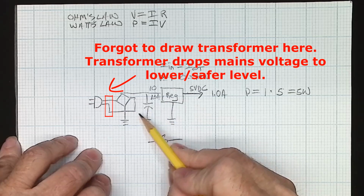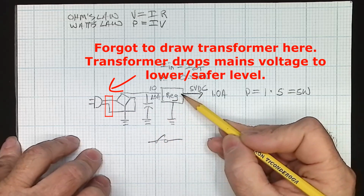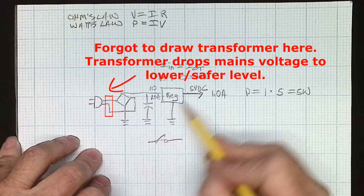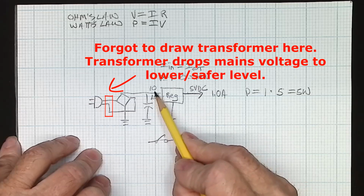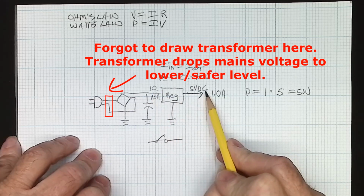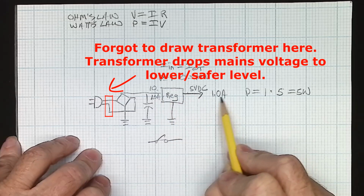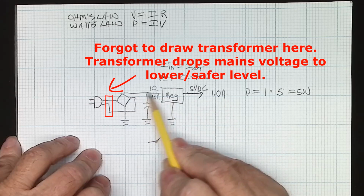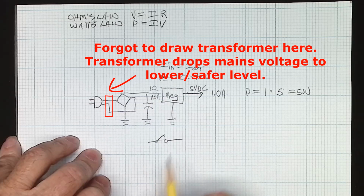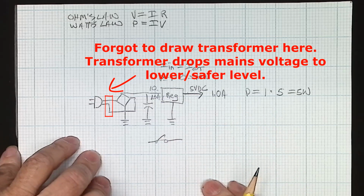And although the switching regulator is not perfectly efficient, they're generally 90% plus, it's a lot more efficient than these guys. So the more voltage you have in excess at the input than what you're using on the output, the less efficient the linears are, and also the more current you're drawing out of the output, the more power loss here. So now we'll look at what we can do to take care of this in our 1541.